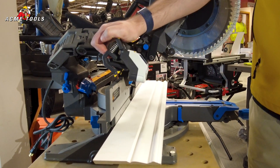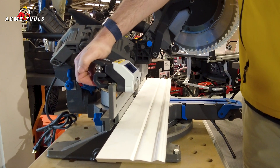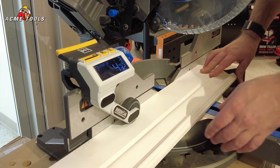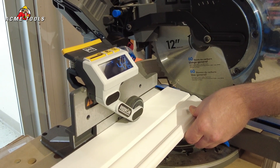Getting started with the M1 is very simple. I first find a nice position that's not touching any ribs on the back of it, squeeze down the clamp until I hear the click, let go, and now the M1 is secured to the fence. Drop the arm down, and then every time we start off a cut, we want to touch off on the saw blade, so we'll slide it over.